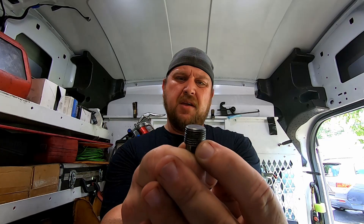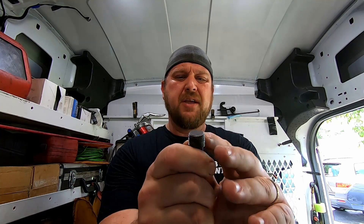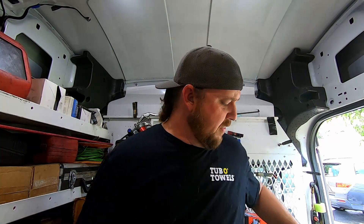That's it for seal face O-rings. I'm just going to speak to SAE stuff — it's what I use and what I know. Next would be NPT, which stands for National Pipe Thread. National Pipe Thread is pretty much the stuff you have in your house that screws together. This is a pipe plug, and basically the threads come on a taper — that's how it seals.